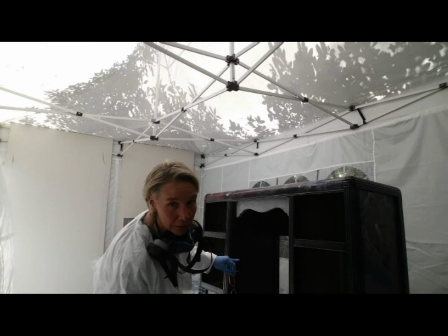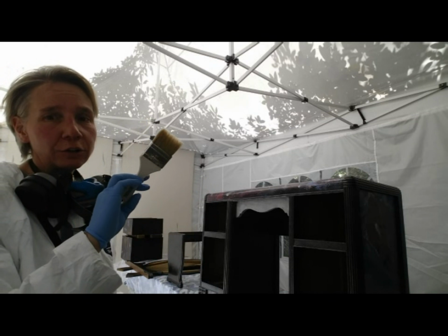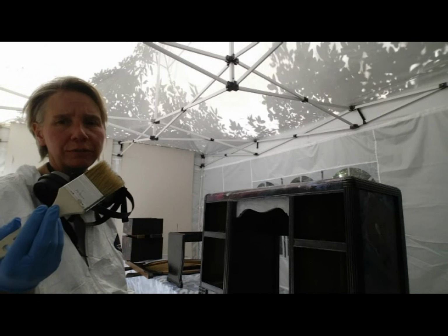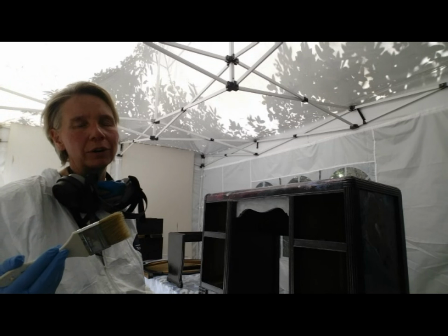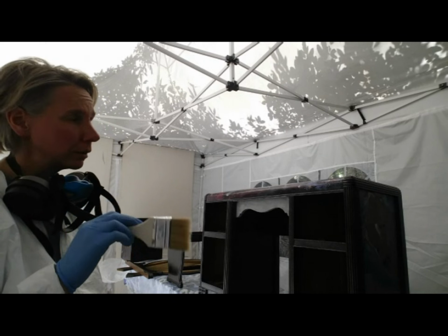So just grab it and lightly pull it off. Try to do minimal work when you're spraying. The last thing you want to see is brush marks. And when you're using urethane, natural bristles only. These little crummy brushes are fine for fixing drips. If you're going to actually brush on urethane, get a really nice, or at least moderately expensive, natural bristle brush, okay? Natural only.